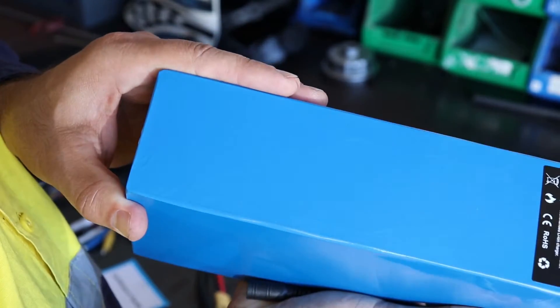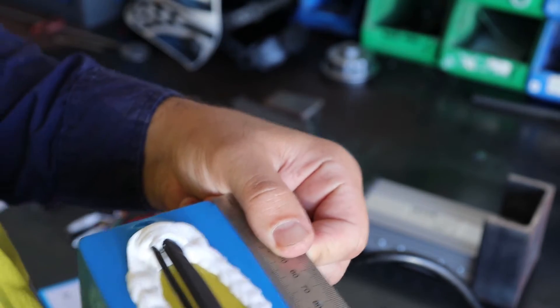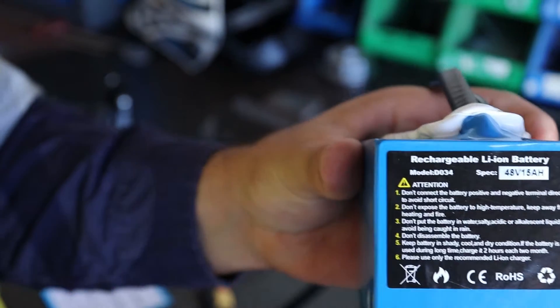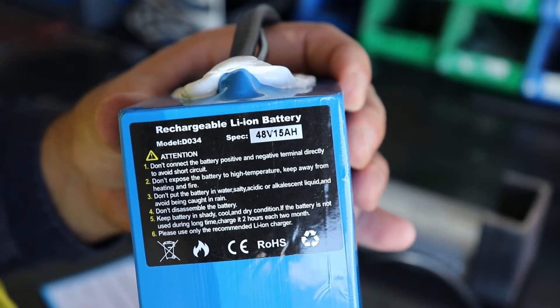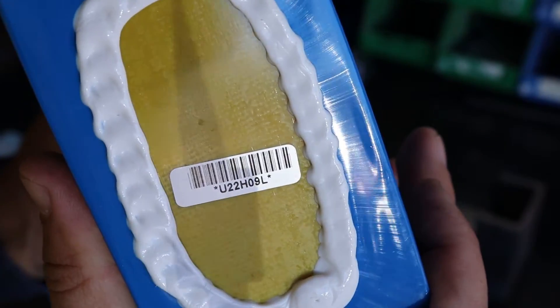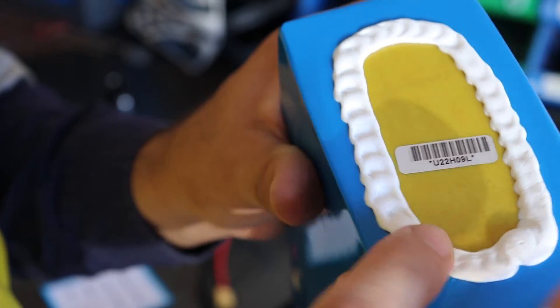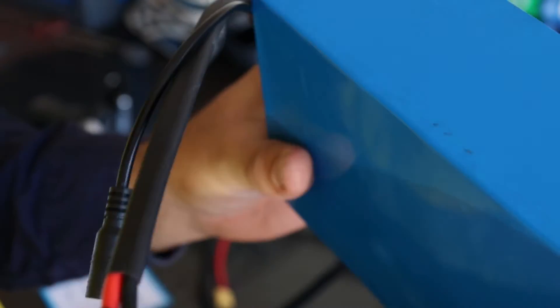So you've got 240 at the longest width. The narrowest width here is 65 millimeters, and this height here is 125. So we've got 125 of this width here. Quick look at the battery itself. I've got this sticker on the back: 48 volts, 15 amp hour. There's no rating for watts on this, but I have tested it already - runs the motor really well. I've also got a serial number on the back. The battery's completely sealed - on the side you've got some silicone across the top, and everything else is a heat shrink plastic. The entire thing is sealed.